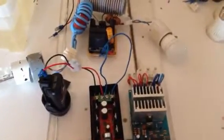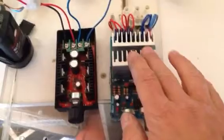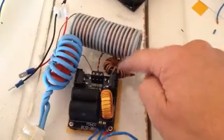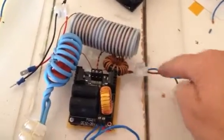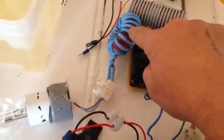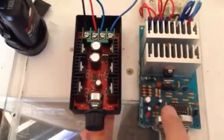Just an update on this solid state lighting setup. Before, we had a 12 volt input into a pulse width modulator coming into a ZVS driver, making an induction coil, with collection from both sides to a CFL light, and through another ferrite ring out to an incandescent bulb. Now I found a cheaper solution to this.